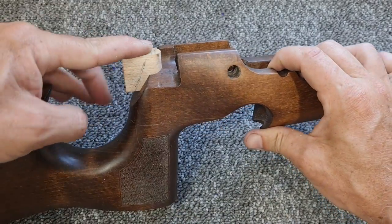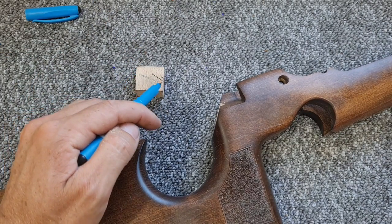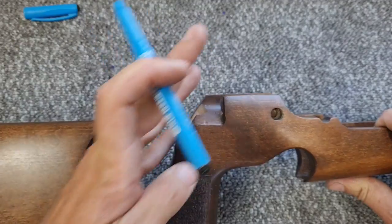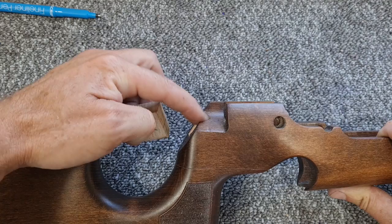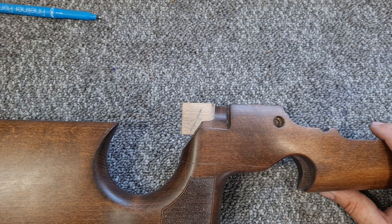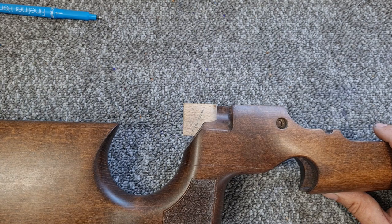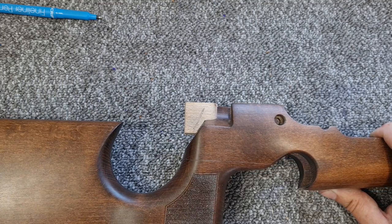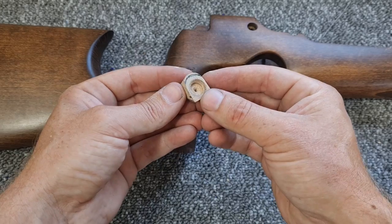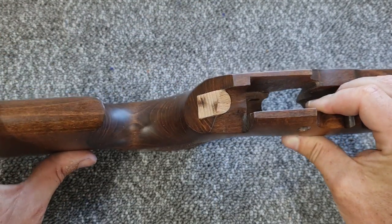I've shaped that up - it's a nice close fit in there and it clears the screw head. I'll rip that off in the band saw, leaving a smear of wood on the outside edge so I can flush that in. I might be able to get a plane in here just to take a gentle skim off, but I think that might be asking for trouble. I'm going to put this in with super glue - I'll just dampen up both edges and the super glue will hold that in beautifully. For something like this it's perfectly adequate to use Loctite or similar; it's not ideal where you might get large knocks as it fractures fairly easily, but this is a non-load-bearing area so it will work perfectly. This is my little infill piece - I've sanded it on the belt sander, added a 10mm hole on the underside, and put a slight radius in there.